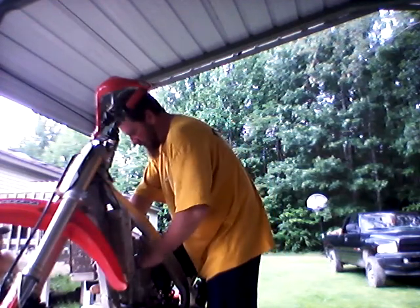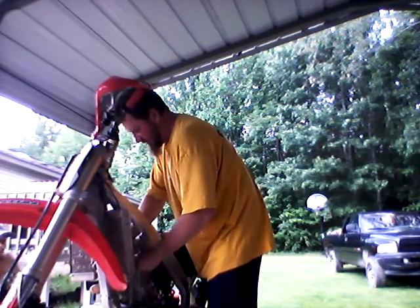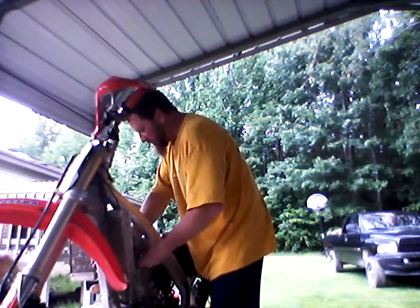Let me see if a 13 will fit. It's 11 plus or minus 1, so a 12 is good or a 10 is good. Yeah. This means it's 1 thousandth out, which I would live with. Yeah, you'd have to. Yep. See, that fits and it's tight. Fits under there too. So you're out a thousandth or so. I think I tried a 14 and it wouldn't go. That's what was confusing me. I was trying to remember all of it. That's why they want you to write them down.